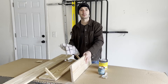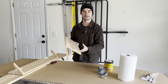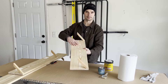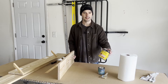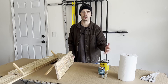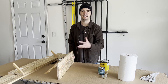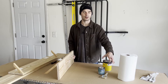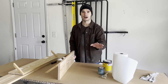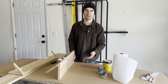I'm going to wipe everything down with a damp rag before we stain it. Let's start with this one — we've got the nice clean side on top; we don't really care about this mark here because it's going to be on the bottom. With stain, I think the longer you leave it on the darker it's going to be, but it also works if you do two or three coats if you want it darker. I'm going to leave it on probably five to seven minutes because I don't want it to dry on me — I want it to be wipeable with paper towels. But if after five or seven minutes I wipe it off and it's still not dark enough, I'll do a second coat and repeat until I get the darkness I want.